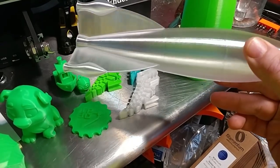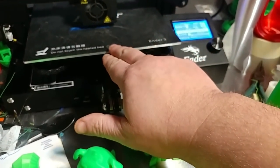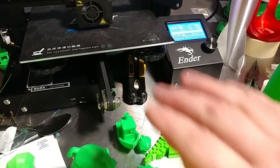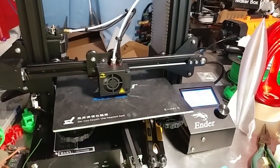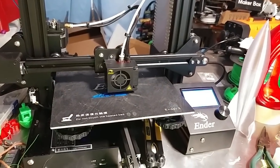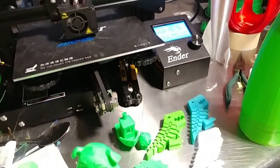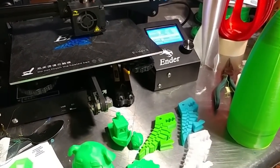The flexi-rex print in Filamentum Noble Blue came out not bad at all. I got rid of those banding patterns — they were caused by the wheels being too tight to compensate for a tilted one. Once I fixed the tilted post, I could tighten them properly and the bed moves smoothly. I also measured the distance between the top and bottom of the gantry and they're identical, confirming something wrong with the base was pushing things outward, which is now corrected.